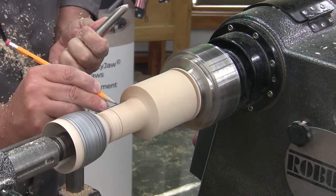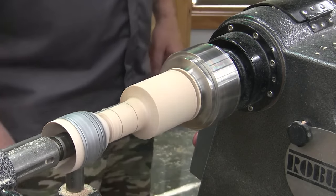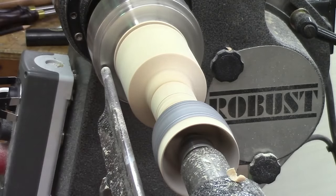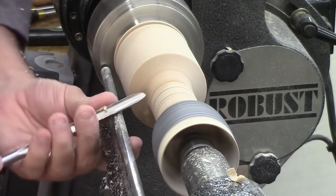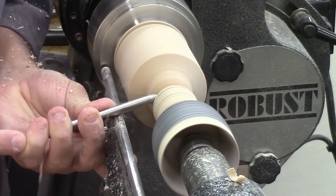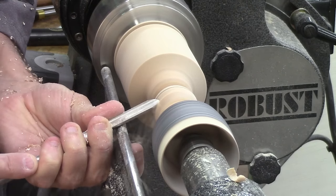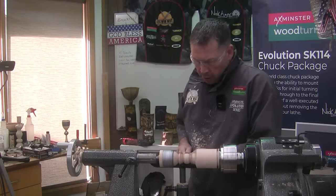Give me enough size - perfect. Let's go for it. It's slightly smaller so I'll go with this spindle gouge. Create some room. Now visually, just for myself, I'm just going to put a high spot on that bead so I know where it is but don't lose it. Then we can come back from both ends. It'll be very easy to lose where the position of that bead is, but once we've got the high spot in there, you can follow it quite easily.